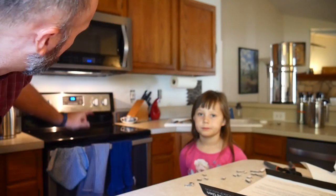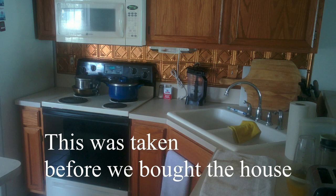So it's coming. But in the meantime, when they went to install the microwave here, they said they were going to have to drill through our previous backsplash, which was sort of this faux copper thing. I'll try and include a picture if I can find one. We didn't like it from the time that we even looked at the house, and we've always intended to replace it. So when I realized they were going to drill through it, we decided to just get to it, rip it out that day, and do something else with it. In the process of ripping it out, we got down to the brown paper of the drywall underneath it. So I had to repair that with some drywall mud, and then we put a special primer over that we got from Home Depot. And now the surface is nice and clean.